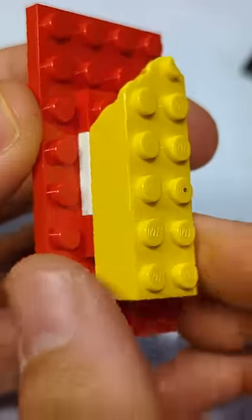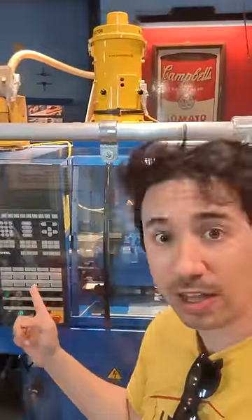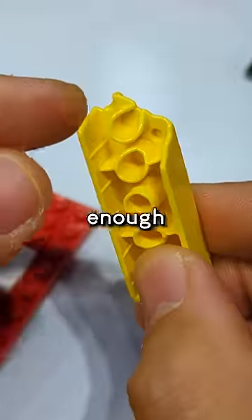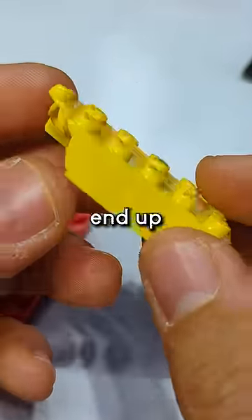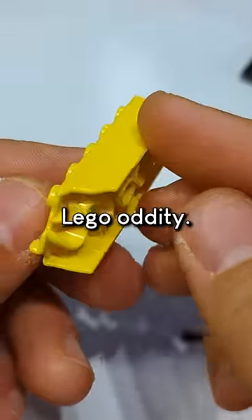What is that? This is what's called a short shot. Lego bricks are made by injection molding plastic — usually there'll be enough plastic to complete the entire brick. There just wasn't enough plastic to fill up the cavity for that mold. It's very rare for these to make it outside of the Lego factory. These would probably end up getting rejected by the machine and then ground up and molded back into other Lego bricks. An interesting sort of Lego oddity.